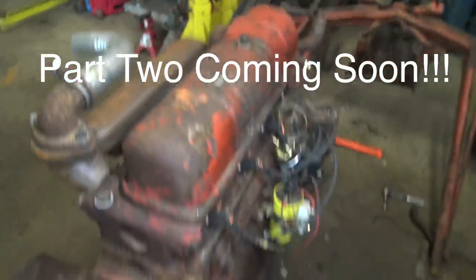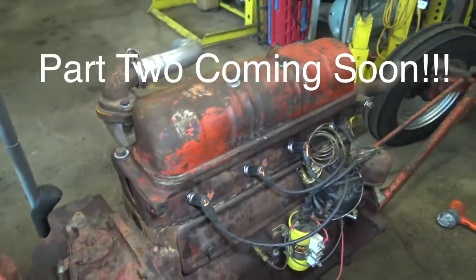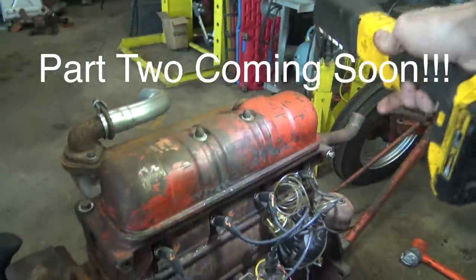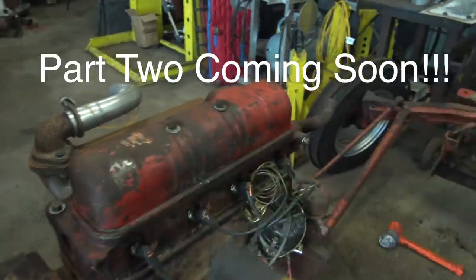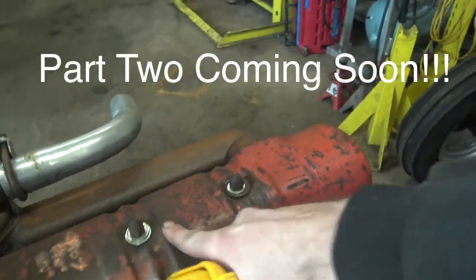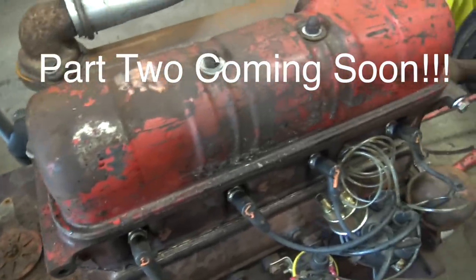Next up, we've got to get the actual engine out of here. I've been looking at this. There are these holes on the sides of the head, one in every corner. I think if I can just fabricate a little bracket for this, it'll give me a nice place to attach onto with the gantry. Some people will pull these just by these studs up here, which I don't really want to do. So, let's see what we can do here.